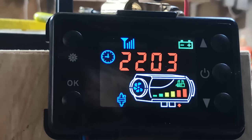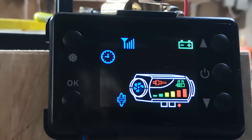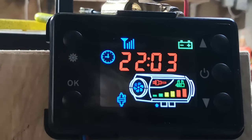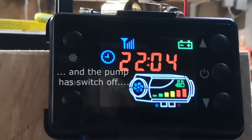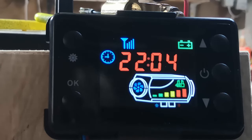I've been running it for seven or eight minutes. Let's do a shutdown. Press and hold the power on-off button — and there you see it flashes off. You'll see the glow plug symbol come back on because it's cutting the fuel; you can hear the fan slowing down, but the glow plug comes back on to burn off any residuals in the flame tube. The biggest draw on your battery is when you start up — the glow plug comes on — and when you shut down, the glow plug comes on again. Interestingly, the pump keeps going for a little while after you turn it off — only about half a minute or so. When that glow plug goes out, the fan speeds up a little bit just to purge any nasties out of there. And now it will just run and run until the thing cools down. You'll see those bars drop away — it takes a long time to cool down. We're down to four bars, then three, then two. Not long from shutting down now. And there we have shut down.